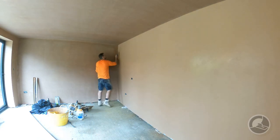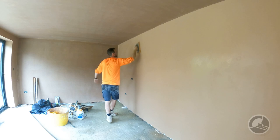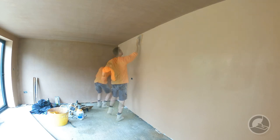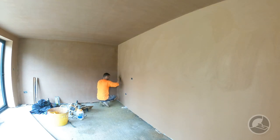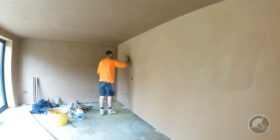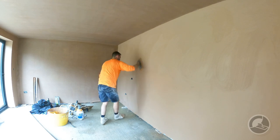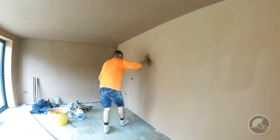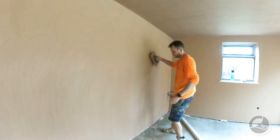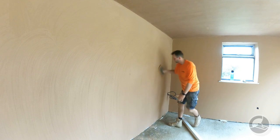All we want to do is just rub gently over the wall. If the sponge is new, you'll find you actually have to open the trowel up ever so slightly. If it's an older sponge, you can just have the sponge flat to the wall. The newer ones tend to push the water around a bit on the wall, which is quite annoying.